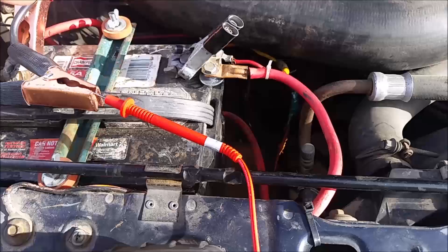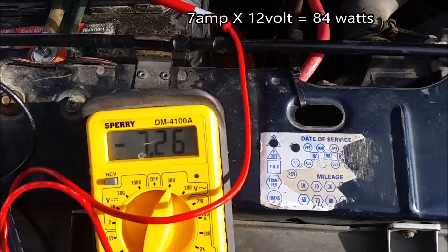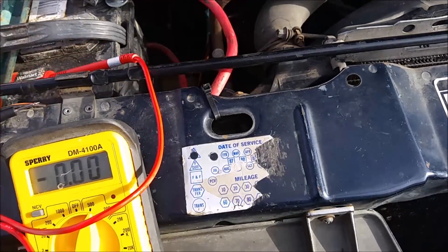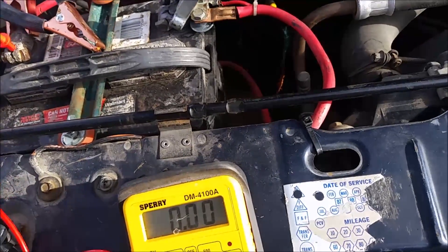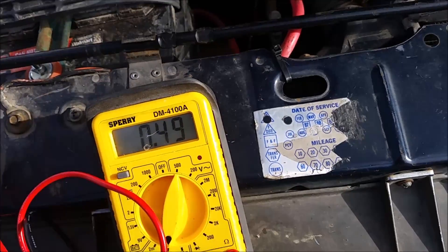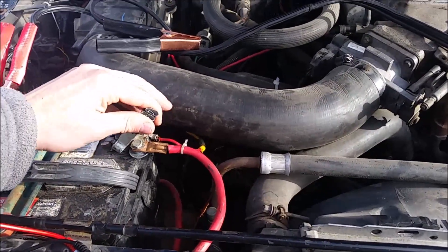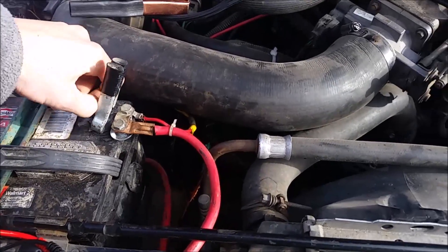Let's do a quick test to see how much wattage this solar panel is delivering to the battery now that it's fully in the sun. Over 7 amps of current being drawn — very nice. Let's also check the short-circuit current. It's about 8 or 9 amps — a cloud just moved in front of the sun momentarily. Pretty good for charging batteries, I'd say.